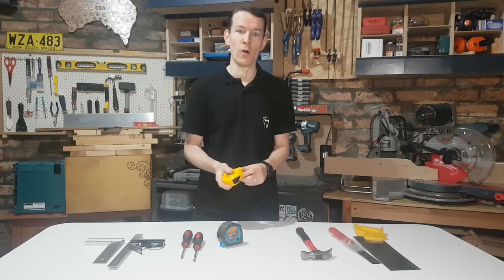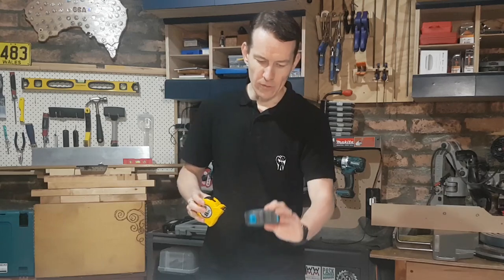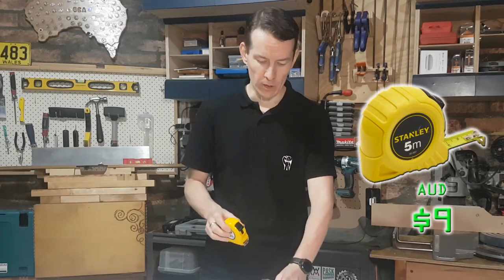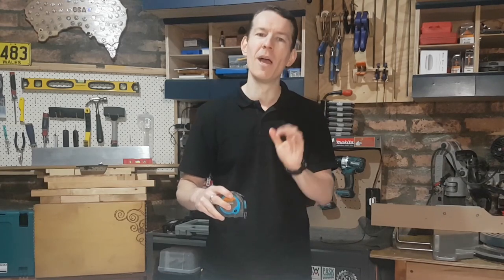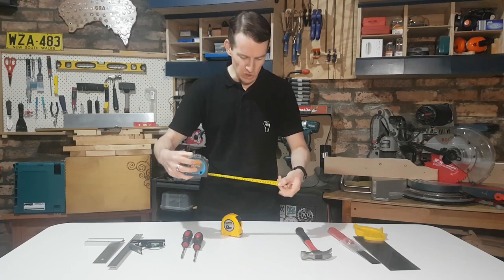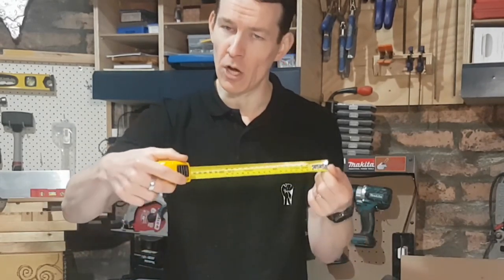You don't have to measure stuff in woodwork if you really don't want to, but the old cliche goes: measure twice, cut once, and your life will be easier. No tool is essential, but it will make your life easier and faster. A tape measure is pretty much as close to essential as you can get if you want to build accurately. I've got two different types here — the Craftright, which is the budget model, and the Stanley, which is a bit more expensive. These are both eight-metre types, but you could probably get away with a five-metre. The reason I like the Stanley over the Craftright is the Craftright covers all markets — metric on one side, imperial on the other. Here in Australia and most of the world we use the metric system, and it's very annoying when you go to measure something and the measurement's just on the wrong side.